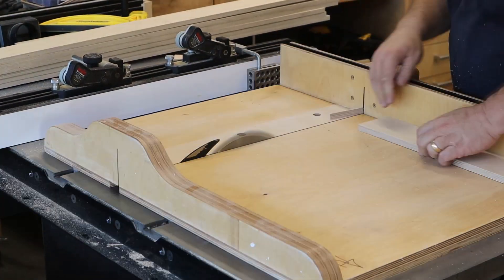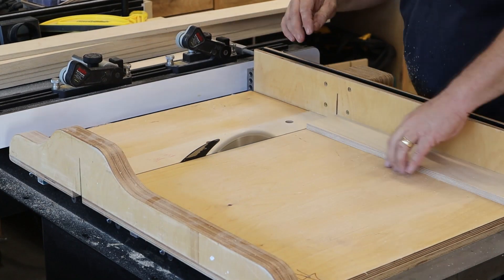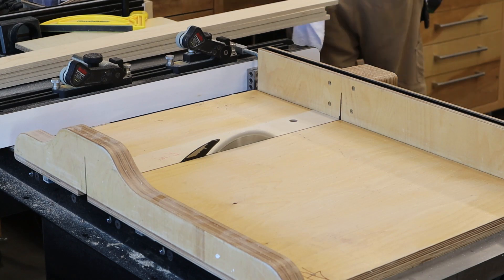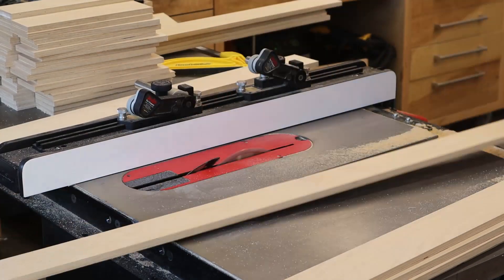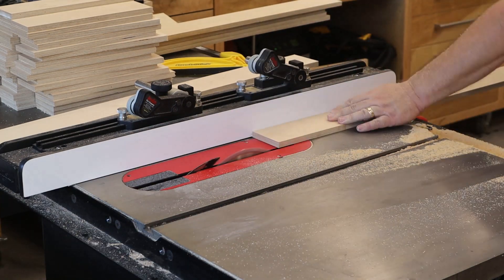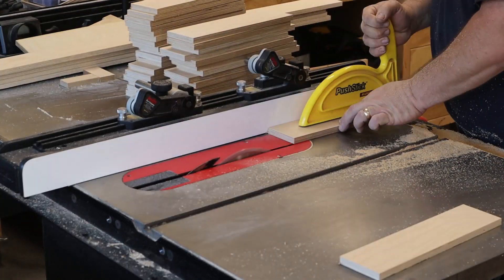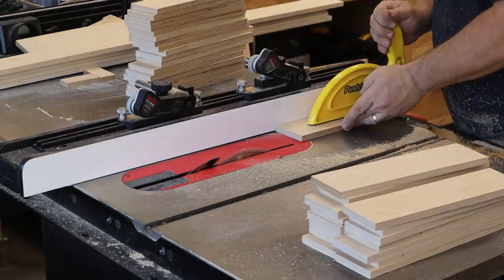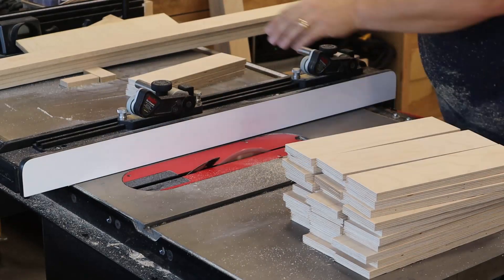At this point I'm using a cross-cut sled on my table saw to get all my ribs cut down to the right length. With a little bit of math you can lay this out so you know exactly what you need — in my case I had them offset by half the thickness of the plywood. As I'll say time and again through this video: it is super important that once you get a clean edge on each side of your plywood, you set your table saw one last time at a final dimension and then cut all of your ribs to that same dimension without moving the fence. This is the key to a flat torsion box.